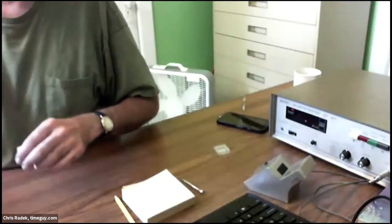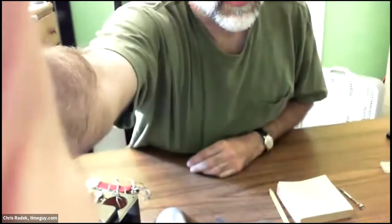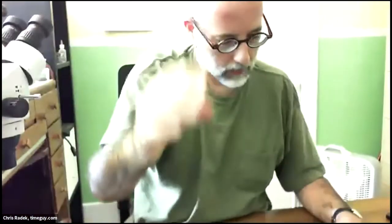I'm going to read this on the timer — I'm not sure how regulated it is right now. No positional dependence, of course. Plus 0.2 seconds a day — that's a pretty good timekeeper. These will be consistent over the years — they keep their adjustment really well, these early quartzes. So Nan, that's what you've got in your AccuQuartz — very cool late tuning fork watches.